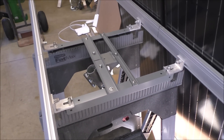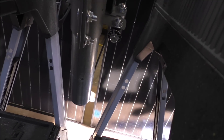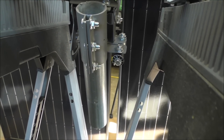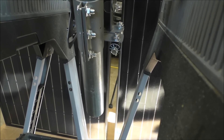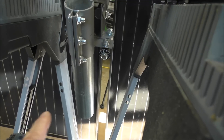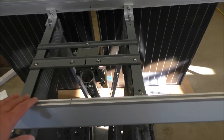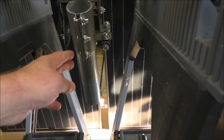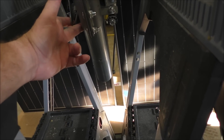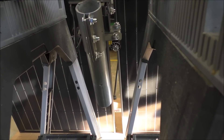Here we go folks — this is the Mars Energy Corporation setup. Right there is my insert. It's a two-inch OD going inside a two and three-eighths with a two-inch ID. That's what I'm putting this section into for the solar pole mount. I drilled it out, made my pole yesterday, and it is heavy duty. This will swivel from a 30-degree to about a 70-degree angle — really good stuff. He warranties everything.